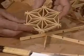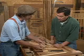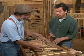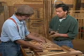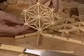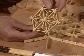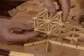But what's astounding is, even though it's so fragile, when you put it together, this is very strong. Once you get the grid assembled, and this is true of the regular kumiko pattern in shoji, the whole door becomes extremely rigid because you've got multiple lapping joints. So it's kind of like building a torsion box.